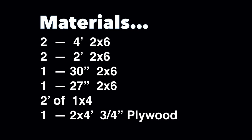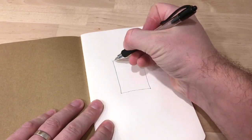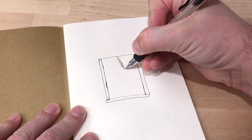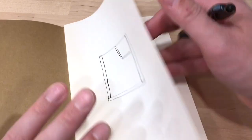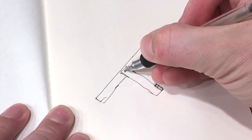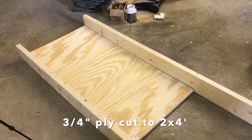Here's the wood you're going to need for the project, and here are the other items: the screws, the staples, the carriage bolts, washers, and nuts. For a gun box, real basic — you need a back, sides, a bottom, and feet. We're going to make the sides and bottom using two-by-sixes, and the pistol tray using a one-by-four. The feet will also use two-by-sixes.